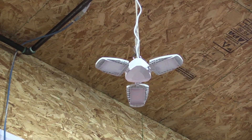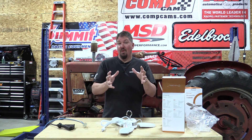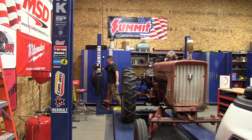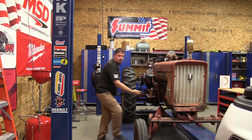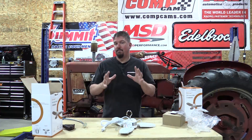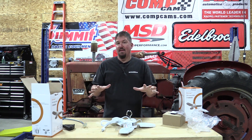My goal here is mostly to get our shop in order for working. We went through deer season and it was great to have the lights, but we found that working in a corner we don't have the greatest light. That led me to where our lift is. I walked around with my lux meter app and got an average of 474, with a low of 263 closer to the tractor and a high of 714. The app may not be perfectly accurate, but we're using it as a baseline.